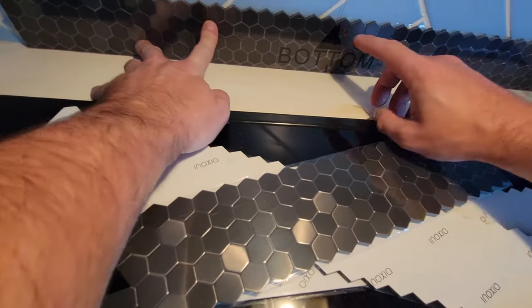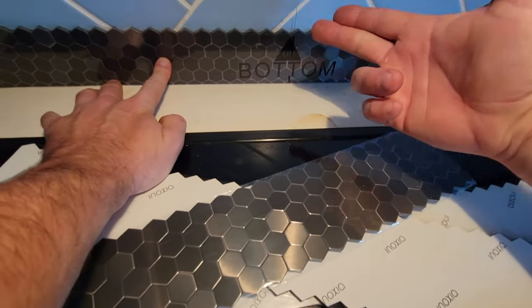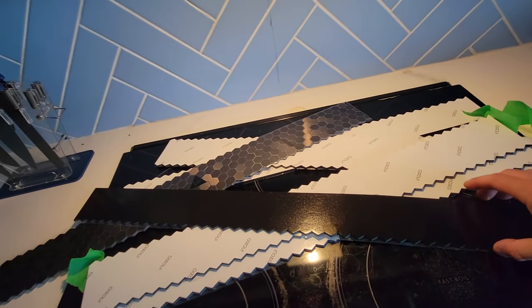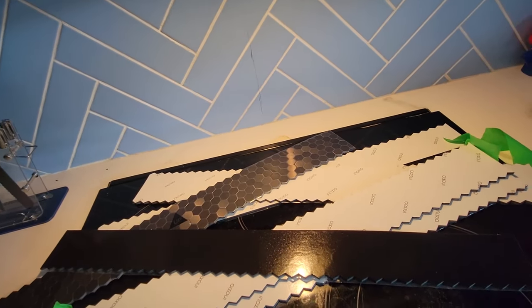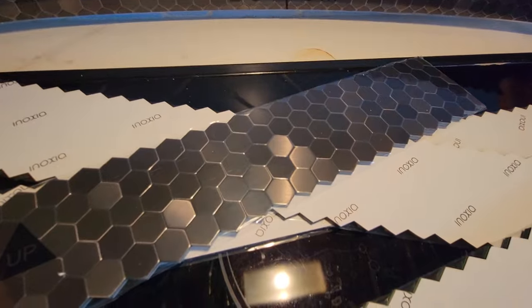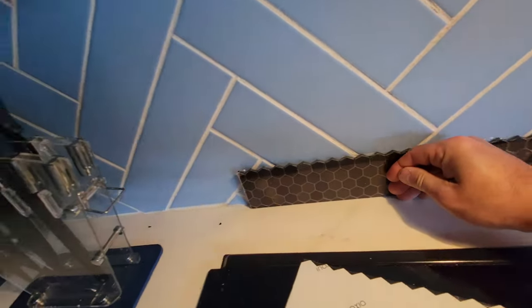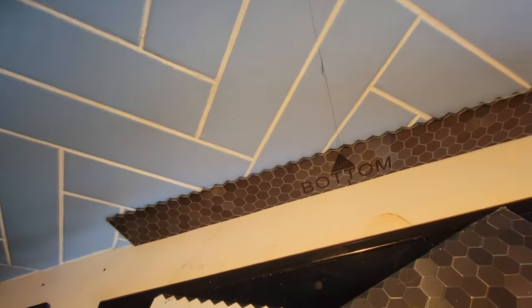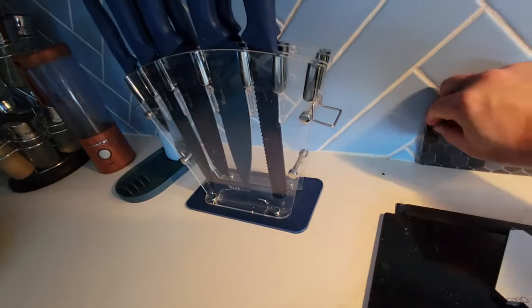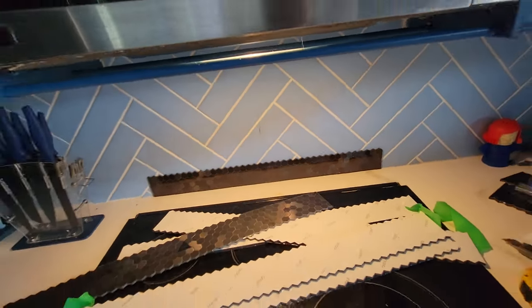Place this mark aligned with the center line — that's how you know where your center line is. Now just peel the adhesive on the back. If you have a spray bottle with warm water and soap, this is when you'd apply it for a slow release, so if you make a mistake you can adjust it. We're going to line this up flat and just press. Assuming your counter is plumb and leveled, peel and the first piece is done.